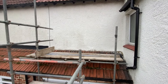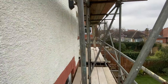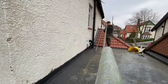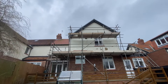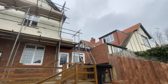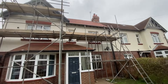That's in - absolutely spot on. Lap set to go on, toeboards on here, handrailing and toeboards on the top, and a little table lift to do on the front - and that's it. And that is the back complete. Just need to put a ladder in there. Table lift on the front now - and that's the front complete as well. Sorry about all the jumps in the video, but this one was just a nightmare.